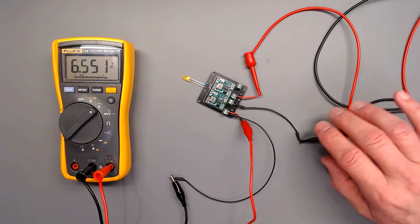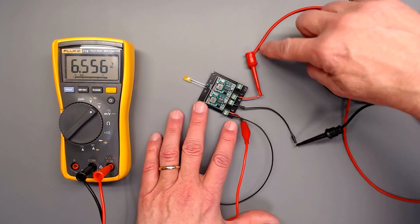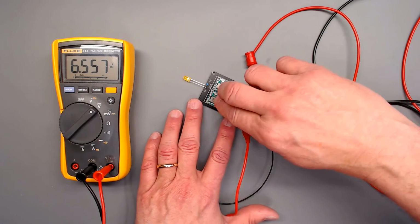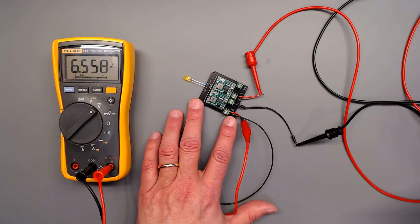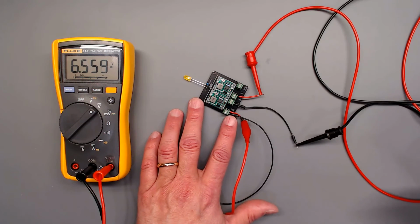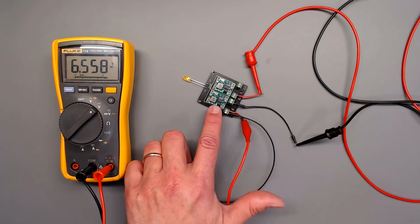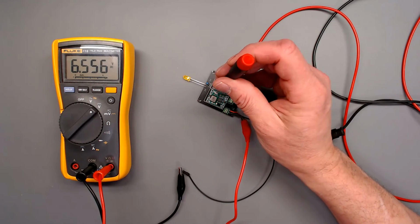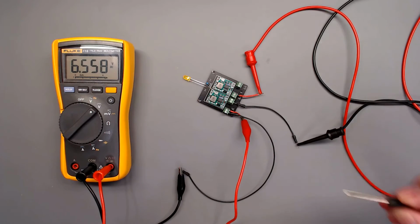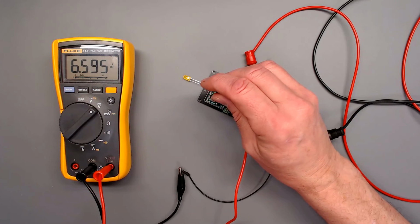All right, to perform the final testing and setting, I've got on these two leads the voltage coming in. I've got my power supply set at 7.5 volts, which will be roughly the nominal voltage coming in off of the 18650 battery pack. And then right now, this particular side, this little power supply, needs to give me 5 volts. And that's the one that'll primarily be powering the PICO. And of course, you got to use these little cute screwdrivers and turn them very gently.